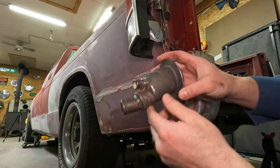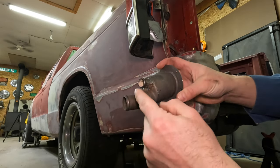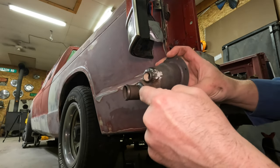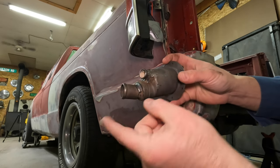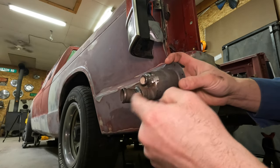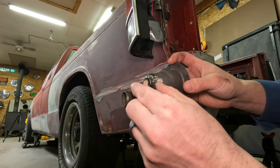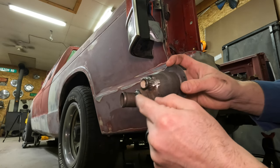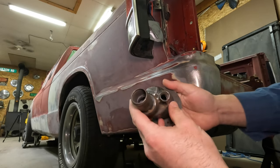First thing I ended up doing is I wanted to change the angle of the main output. So what I did here, I did not cut through the whole thing. I came through about two-thirds with the old hacksaw. Bumped it up with a rubber mallet. Kept coming down with the blade, bump it up with a mallet, so I could slowly start chewing away on my pie cut. And then I just kind of welded over that. Came out pretty good.